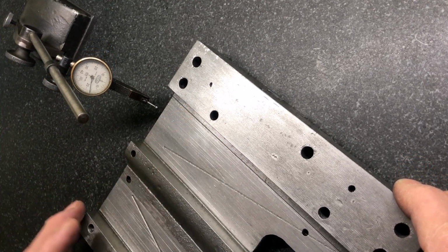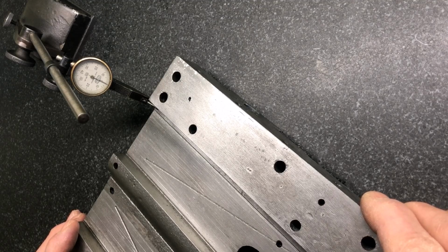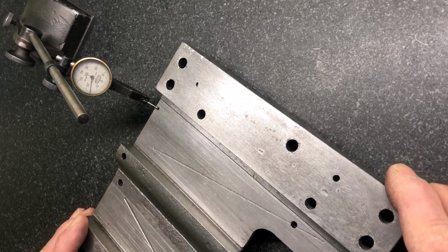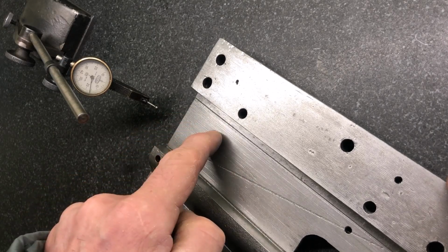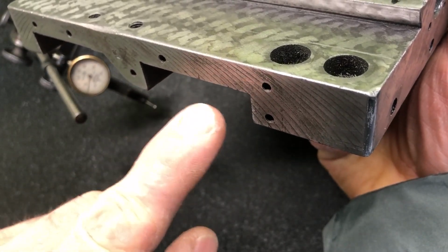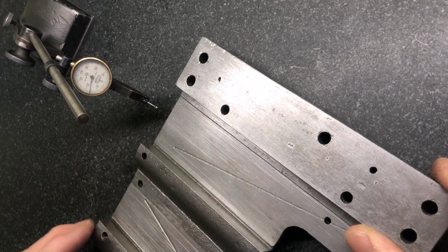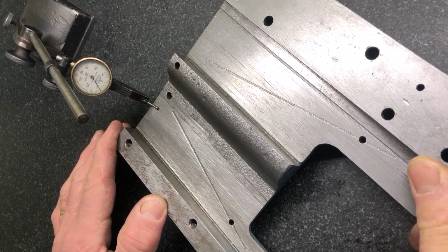This strip of land here is really then representing the original geometry. So if I then assume that this is 0 here, I can go across to the worn surface and see that this is massively worn here. And this is quite typical also, that this being the most worn surface, say quadrant, and at the front, underneath here, the front pocket, so to speak. Dirt ingress, and then also then normal wear, and then tool pressure here will then make this the most worn surface here. I have also wear here, quite extensive wear actually, but not fully to that degree.